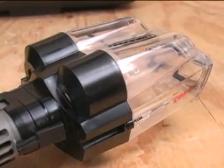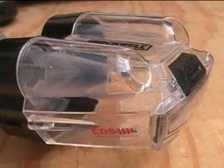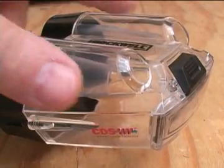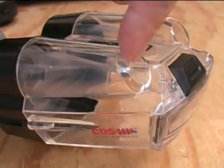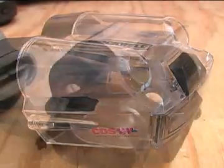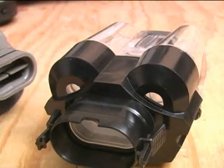Rockwell calls this a cyclonic dust air separator, and it's more than just a fancy name. This container has a pair of Venturi pointed towards the back of the box. It looks like the exhaust air would come out of the back of the box at these end plates, but it doesn't. There are ports on the front of the dust box, and that's where the air, now without dust, comes out.